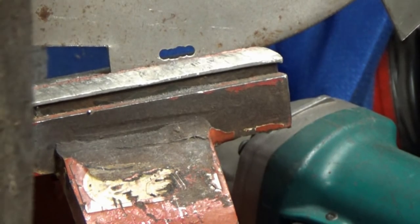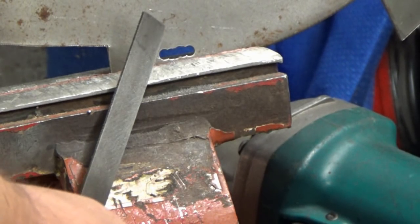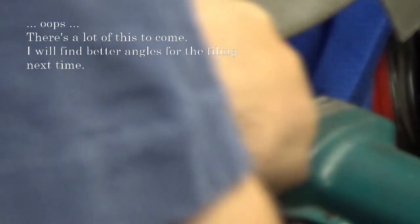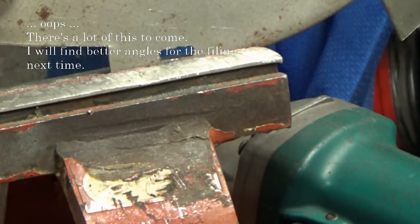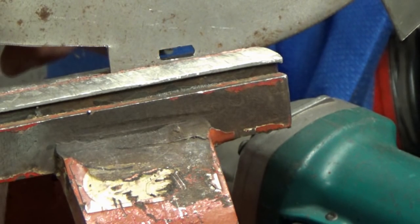But first I just wanted to show this technique: you just drill or punch a series of holes and then take the appropriate needle file — just a flat file like this — and work it across a few times. There we go, just about done. Take the rivet you're going to use, give it a test — so that moves fine in there. Then we'd rivet the plate together. But what I'm going to do now is show how I'd use a chisel with two holes at either end.